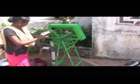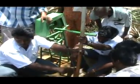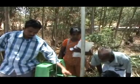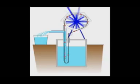Turning the pulley wheel makes the rope move. The pistons give minimum play in the rising main and suction the water up. The whole rising main functions as a long cylinder in which the pistons only move in one direction. When it gets to the top, the pumped water is diverted to the user's bucket.